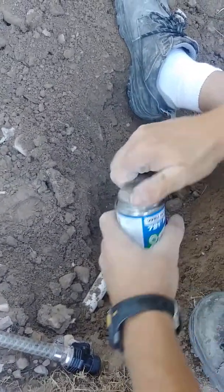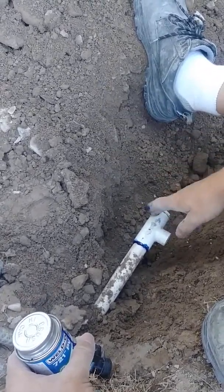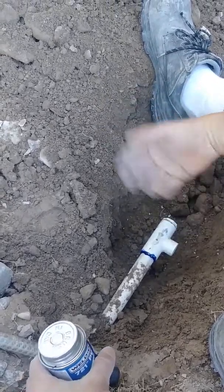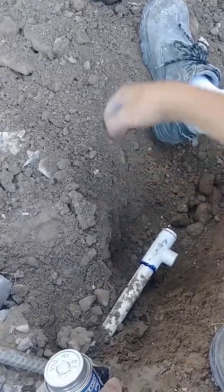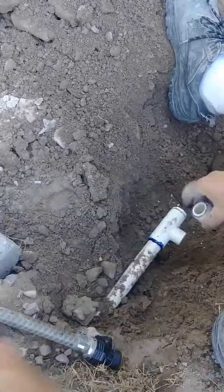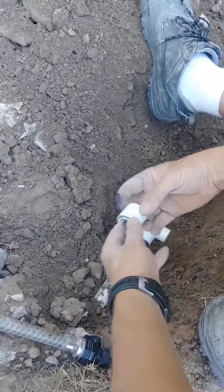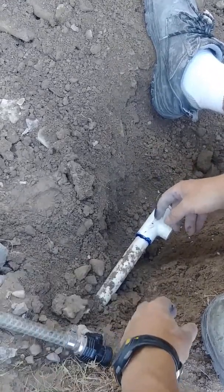This is how you repair your own sprinklers. I had to do this because I was getting a foundation lift — I had to dig all the dirt and use an excavator to clean it all out. Sometimes the sprinklers are right there and you know it, but sometimes the excavator really needs to get down there and it hits and breaks them. So you just cap it off after you break it — these caps are only three cents to a buck, no big deal.